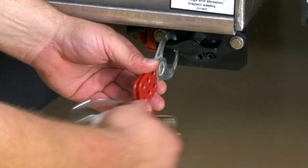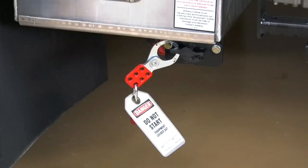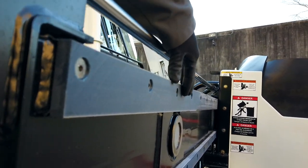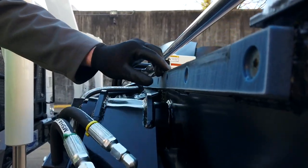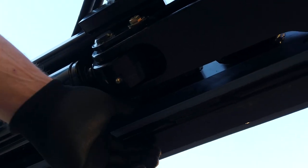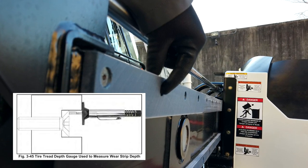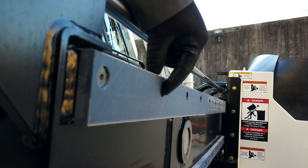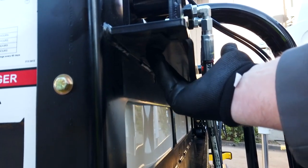To check the slide assembly, first remove the lockout tag out. Then fully extend the carriage and place the unit back into lockout tag out. Check all four nylon strips on both sides for wear or damage. The slide assembly guides on four replaceable UHMW wear strips. The strips are designed to be used without lubrication — adding lubrication will severely reduce wear strip life. Use your tire tread depth gauge to determine if the wear strips need to be replaced. Measure from the cap screw head, not the recess. There should be at least 1/16th of an inch of nylon wear material present at each hole. Replace the wear strip and cap screws if any hole is less than 1/16th of an inch. When replacing the cap screws, be sure to use a thread locker. Check slide carriage steel wear strips for wear or damage; when new, this strip is a quarter inch thick.